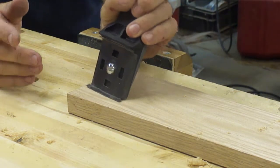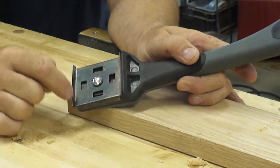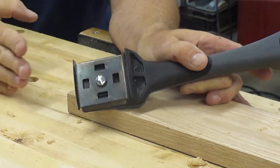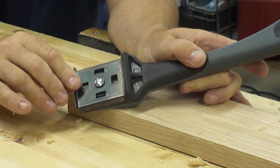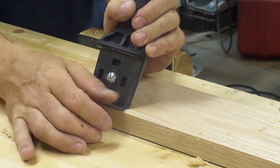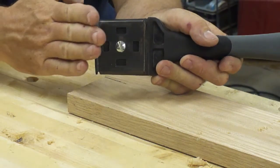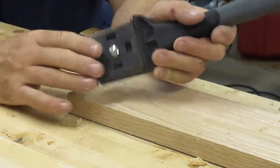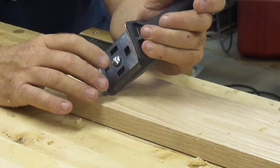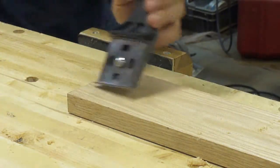So, anyhow, when you look at the tool, it has four edges on it. The edges have curvature in them. They're flat on the back. They have a chisel grind, which means just one flat bevel. When you take the tool out, it's got a burr, which is that beveled edge folded over. That'll cut, but it'll get dull after a short time. It's also a jagged edge. You can do better.